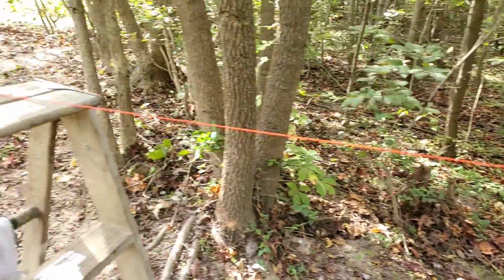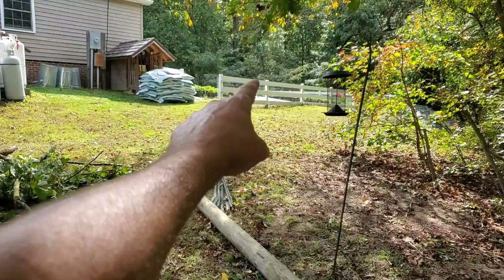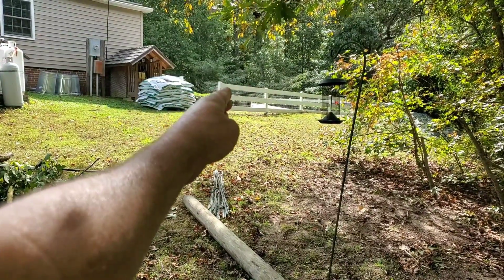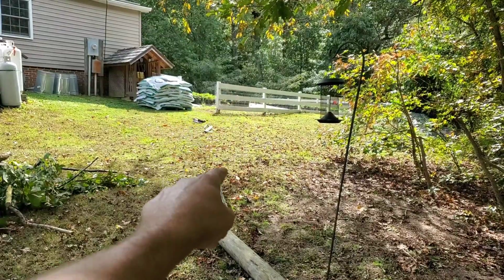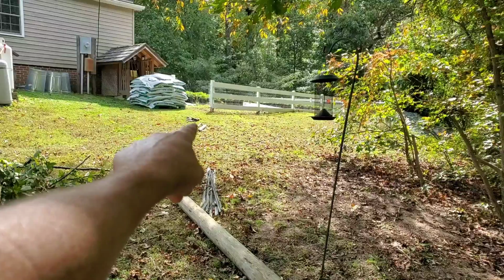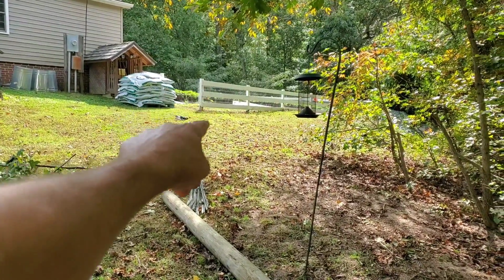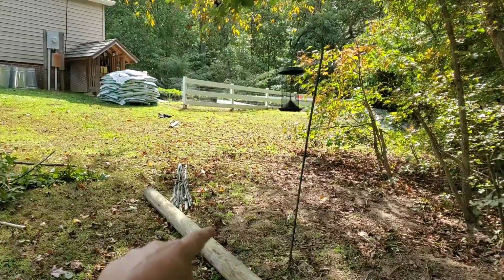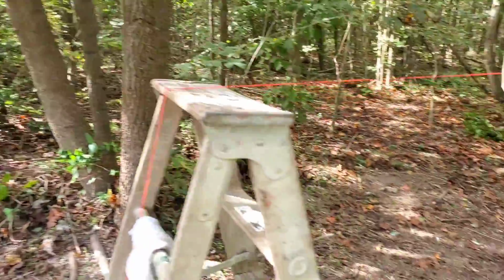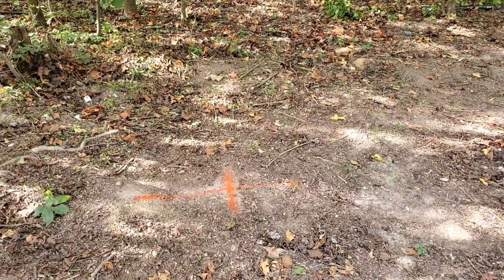So the way I've got this fence going is, this is the strawberry fence right here, this white corner. So it's going to come off of this corner, and I've got the T-post right here, and I've got it marked out. There's my T-post driver right there, and I'm getting ready to put those T-posts in coming down through here. This is going to be the corner.